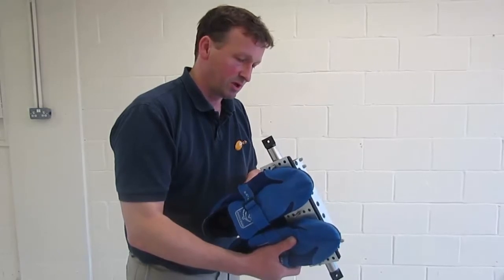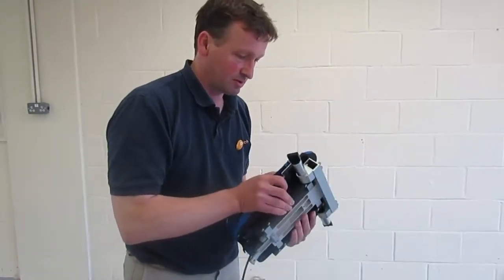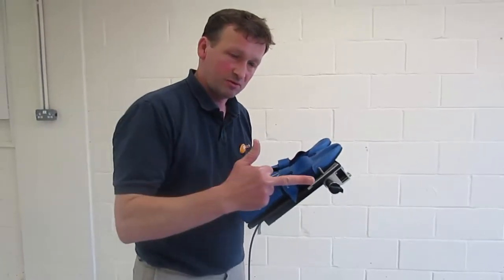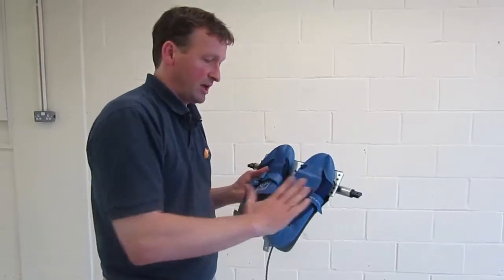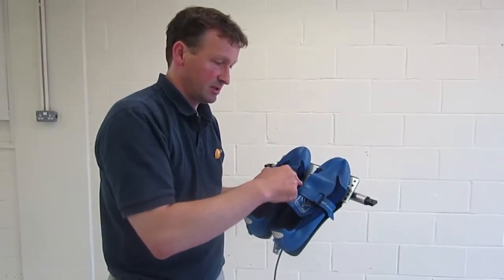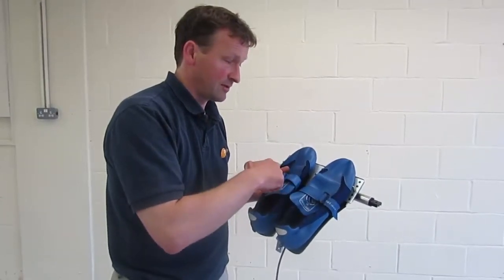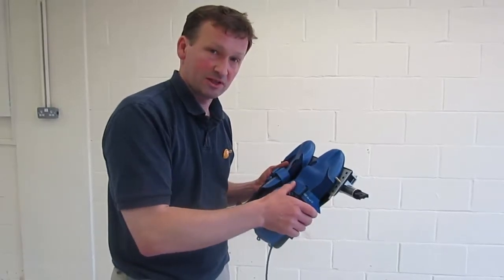It's not influenced by many other factors that you get in other stretcher force sensors. So we're measuring the horizontal force, the vertical force, and also where on the board the pressure is centered. That's measured in terms of distance right to left and distance top to bottom from the center of the sensor.